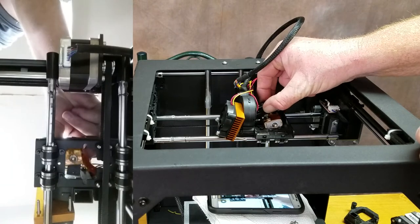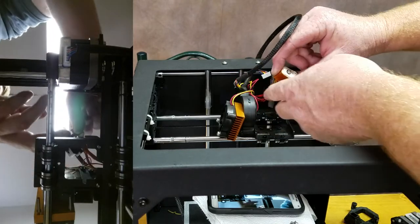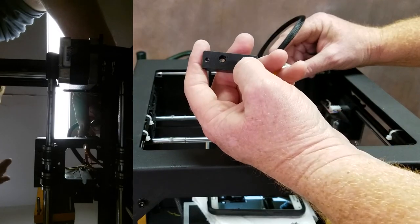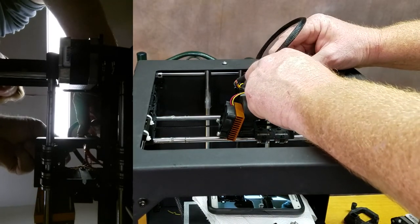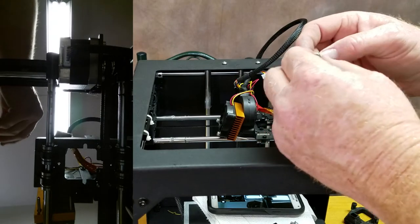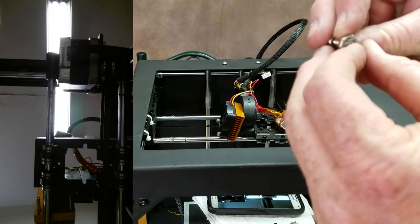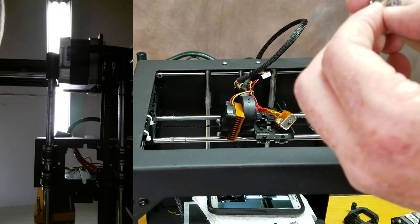Now I can pull this out from here — gently, keep in mind this is still warm. It's cooled down enough where I can grab hold of the insulation. I'm just going to start rotating this since I already previously loosened that nut. I want to make sure that piece with the screw is facing downward. The nozzle throat is cool enough now to remove it. I can see the Teflon that's chewed up right there at the throat — that's where it's been getting chewed up by the carbon fiber.